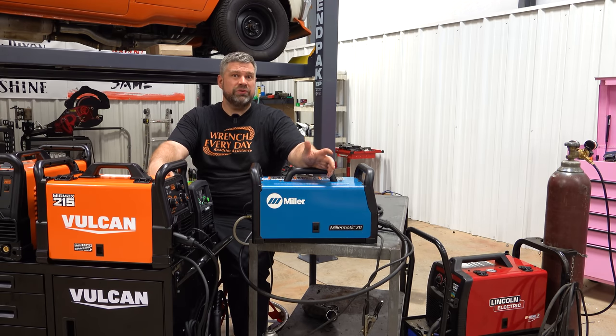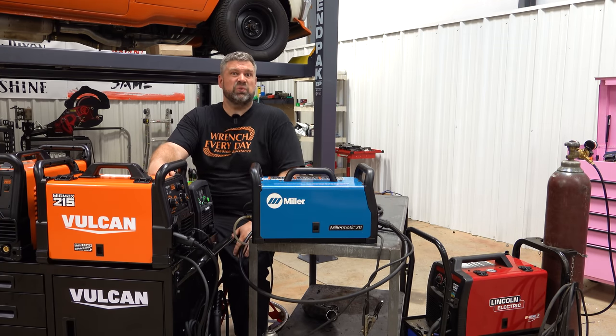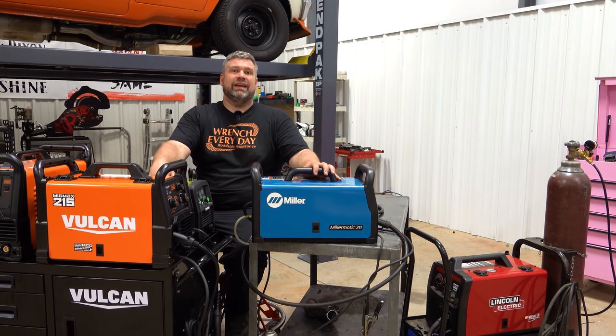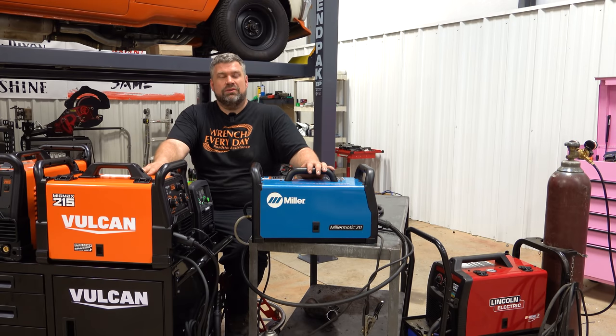They aren't the most energy efficient for the power in versus out. Most online articles rate them at about 60% efficiency. So if you're welding all day long in a dirty environment, you're going to see a higher power bill than you would with some of this new technology.